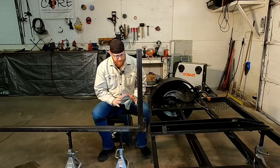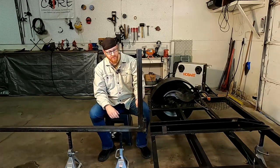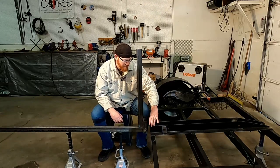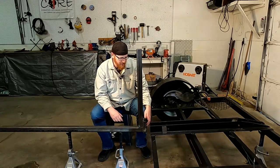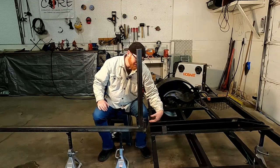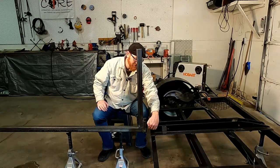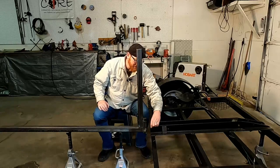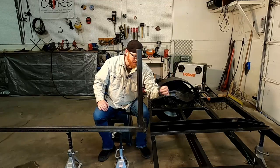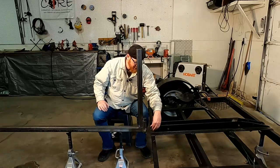We have the main piece constructed — the main two inch receiver, the mast coming up, our interconnecting piece, and the rod that's going to slip in here. Now I'm going to make my C slots here and here. Because this is at the outside edge and could get knocked sideways, I want to add strength by welding in these little quarter inch plate pieces.